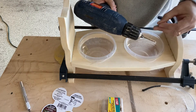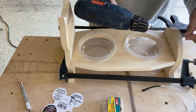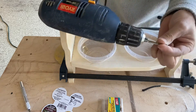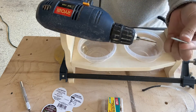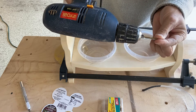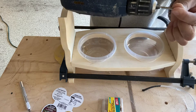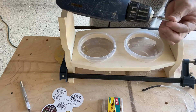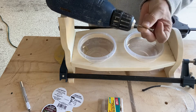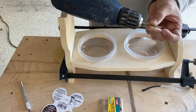I decided I'm going to use screws and glue. I picked out a drill bit — this one's 3/32 — and as you can see, if I hold the screw up to the width of the drill bit, the threads are sticking out beyond it. I put it in far enough that I can screw all the way until it touches the wood and be the exact right length. I can actually go a little further since I'm going to plunge it in a little bit more.